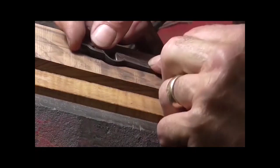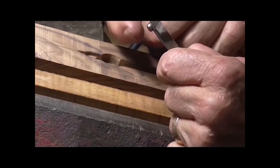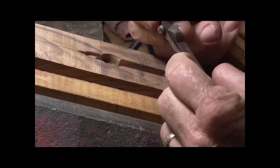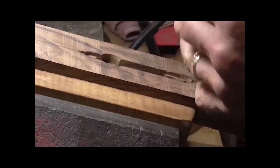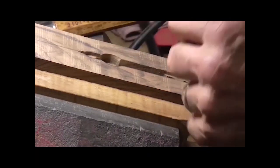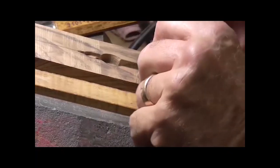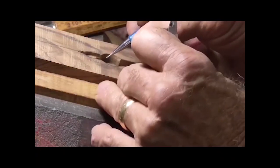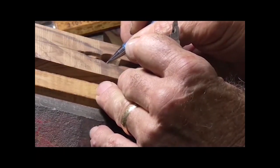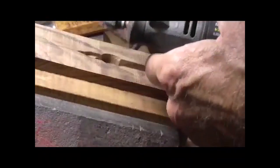There's a screw sticks down right there. See that screw holding that spring on? I just located the center of it right there by tapping on that. I've got to drill looks like about a 1/4 inch hole right there. Chew it out with a Dremel.